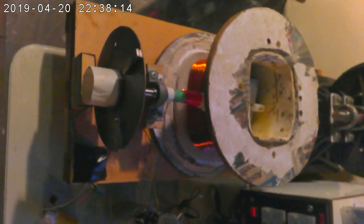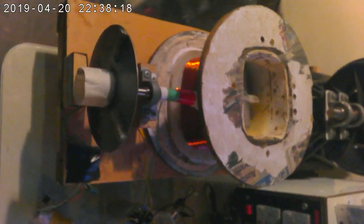Okay, a few minutes later, and half a beer, and I've realised I can make this last video a little better. What I plan to do is turn it on again, which is what it's actually been doing. It's got this slight oscillation going, and it won't quite finish a rotation, and that's with no input power from the power supply. That is purely from the power coming from the input transformers through the base of the transistor, which is in the interests of accuracy, not actually being metered. So when I say before the input power was 0.6 of a watt, it was probably more like 3 watts.